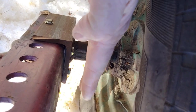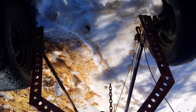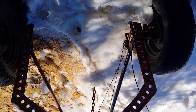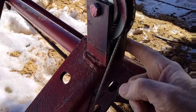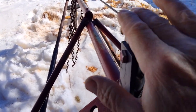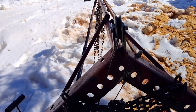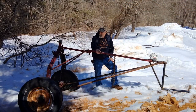Getting the toe in line is important to keep from wearing your tires out when pulling the log arch down a hard road. You can see I've got washers in the back on one of them to move that wheel into alignment. If the toe isn't straight and you get onto a hard surface, the tires will shimmy and wear out prematurely. The pulley up top is a simple design — two pieces of flat bar welded together with a bolt through them and a bearing pulley in the center. On Tim's we added a small piece of metal over the top so the cable can't jump out of the pulley, which I still need to do on this one.